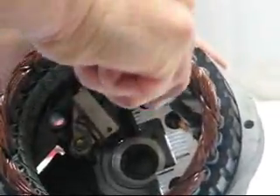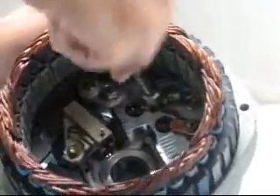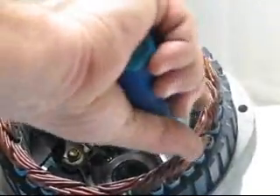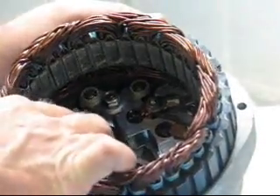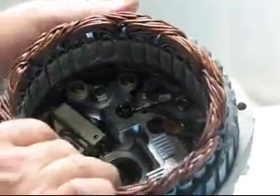You want to make sure these are good and tight. If you get a loose electrical connection here you have to watch it - make sure these are tight enough. They should be as tight as you can get them without stripping the screws out; you have to be cautious of stripping those screws out. Now I'm going to push that toothpick or wire way back in on that brush holder so it doesn't hit on anything. Now I'm actually ready to assemble this alternator back together. We're not going to be doing bearings in this - that will be another show. This was just about replacing the bridge rectifier in the alternator, and you can really use this for replacing the regulator too.